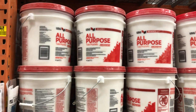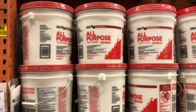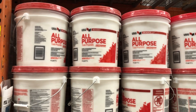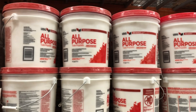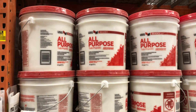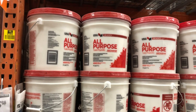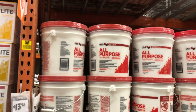All-purpose — it's not light, it's just all-purpose. This mud has a lot of glue in it, and once it dries it's really hard and really hard to sand. This is taping mud. Consider it to be taping mud — it's great to put your tape on and corners on, and then put it away. Don't recommend using this to put a coat of mud on. When it dries it's rock hard, really hard to sand. It says all-purpose on the bucket but it's not — consider this to be taping, just use it to put tape and corners on.